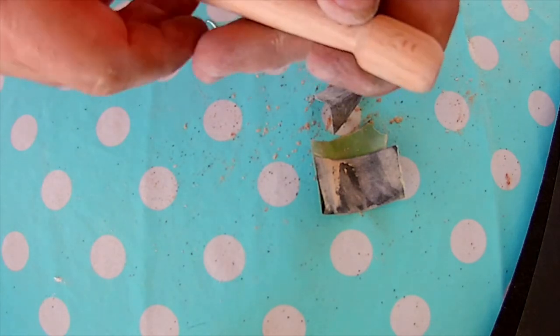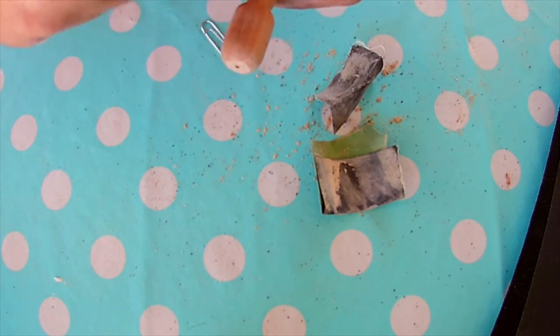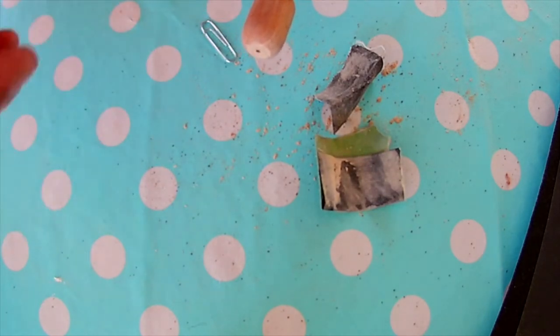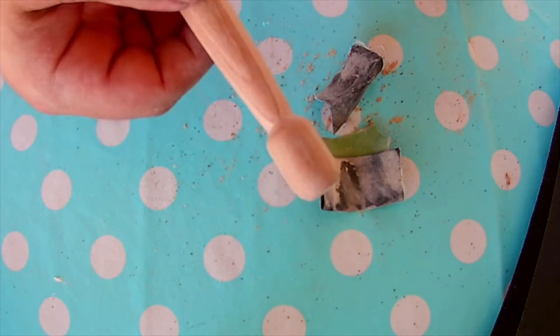Now I need to drill a hole and cover this with some sort of protective wax. I'll drill the hole offhand, just hand drilling it 3 millimeters. Then followed by 5 and 8 millimeters, which are going to be the final diameter. So let me get started. I won't show you that. It's going to be off camera.